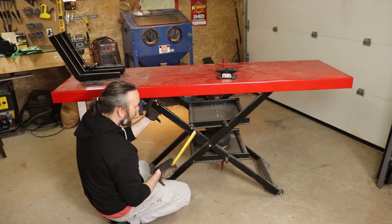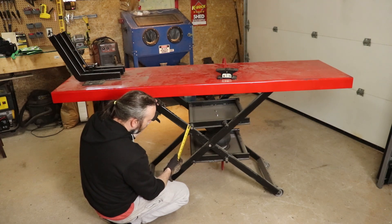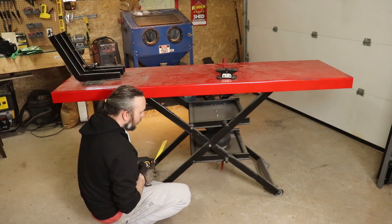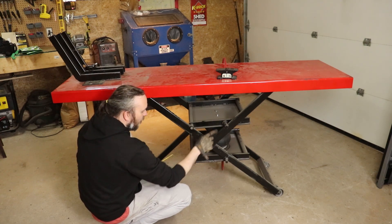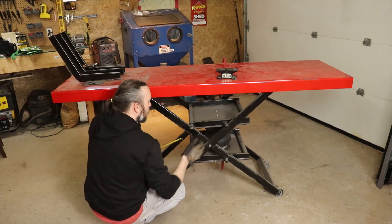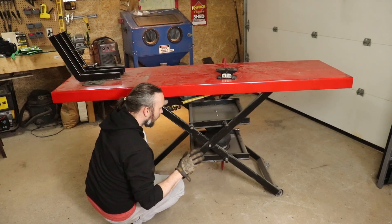All of these pivot points and mounts for all the bearings are made of simple 3/4 inch bar stock. The C-channels that the pivot points and the bearings ride in are all the same as the 1 by 2 steel, just with one side cut off. Those are on both pieces, 18 inches long — so you want four pieces at 18 inches long, cut like a C-channel.